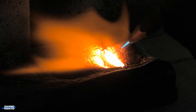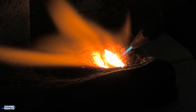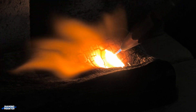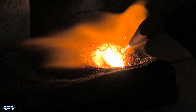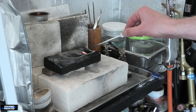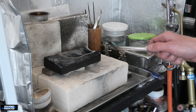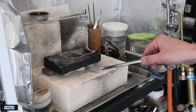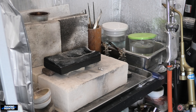Basically, get all your bits to melt together, and then you might want to take the flame off and roll it over to melt the other side, making sure you're getting it all melted together. It's useful if you can melt it into a long kind of shape — that's going to go through the mills much easier. Rather than ending up with a ball, which is more difficult to hold and put through the mill, I like quite a long shape. It's still really hot, so I'll put it down somewhere safe and let it cool down a bit.